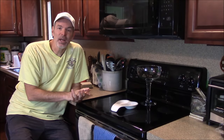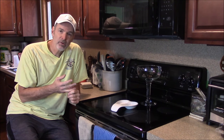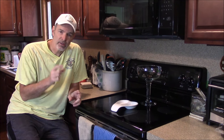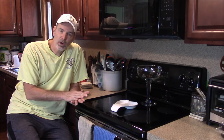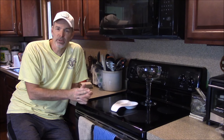I have two stoves installed and it really couldn't be easier. Whether it's a three-prong wire or a four-prong wire, just match the colors up if the wires are color coded. If they're not, two things to remember: one, identify the neutral — which is probably going to be the middle wire on your plug — hook that up to the white wire, and the other two wires don't really matter. And if you don't have a ground wire, make certain that there is a grounding strap connecting the ground to the neutral and you'll be good to go. You want to work safely — turn the power off. But if you have the slightest hesitation, get this project done by a licensed and insured electrician to make sure it's done properly.